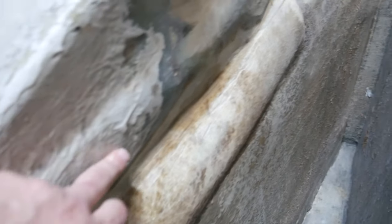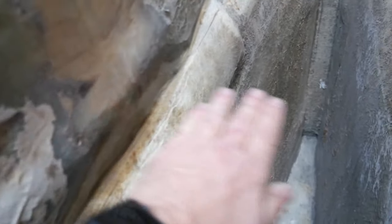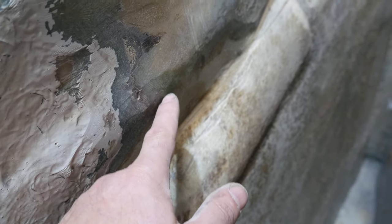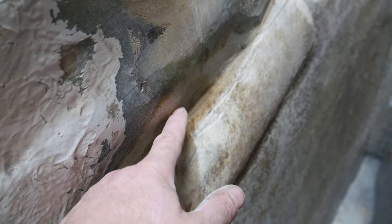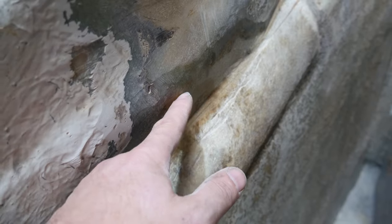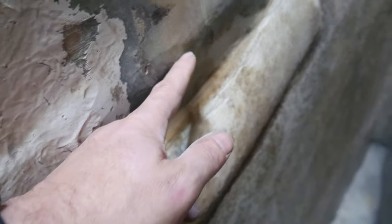It's a little bit of a tight squeeze down here - I can actually stand in it. First up, I removed that tabbing all the way along here that basically went over the top of the tank. The problem was I had to chase that seam all the way back because the oil had actually got up under that laminate join all the way to where the two pieces met. To get that last bit of black line out I had to be really thorough and take it all the way back. That part's done.